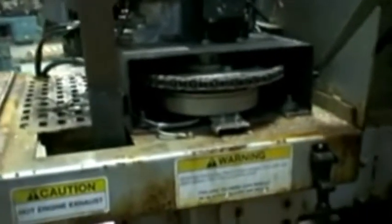Additionally, this linkage up in here for the throttle can become rusted up solid, so we need to make sure everything is moving, and before we finally get this engine put to rest, we have to maintain the chain underneath. So it's better to have the engine running, and we can engage the clutch and so on, so the chain can be moved and we can lube that, and once that's all done, then we're going to run the engine dry.